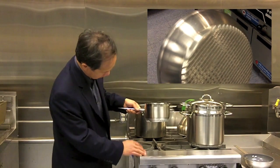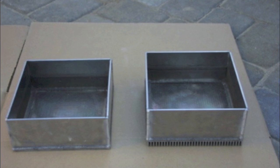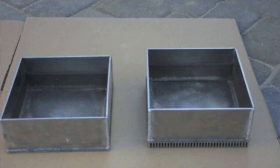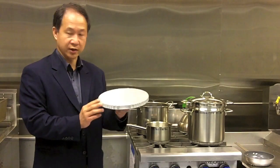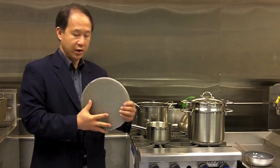Now, we flip it upside down to absorb the heat from the flame or the range. I went to a machine shop, asked them to make a heatsink — an 8x8 square plate with a fin on the bottom. The next step was to extrude the heatsink like this, and water jet cut it in a circle, and weld it to the normal pot.